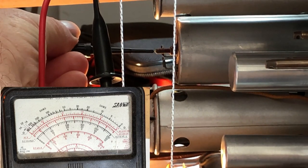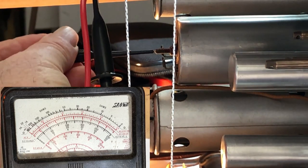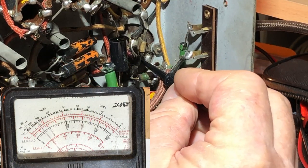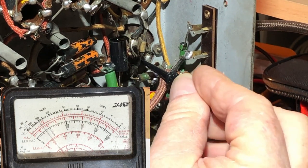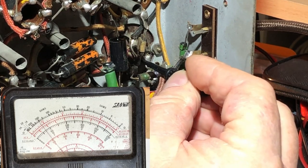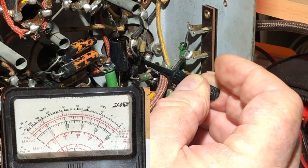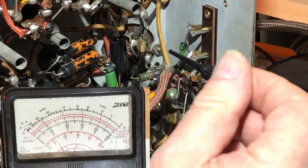I don't think I'm going to get very much out of this. Hardly worthwhile, that one. Just about nothing out of it. Next is the bottom of the same coil, the bottom of the second IF. And these adjustment screws are very stiff, caused me no end of trouble. But that one's coming up a satisfying amount, I suppose. Not huge, it wasn't that far out, but at least I got something out of it.